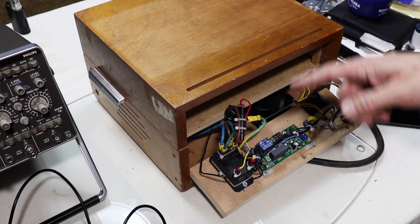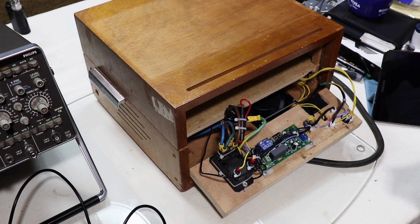And it had an aluminium front panel and then a slot here in the front where you put in an 8-inch or up to an 8-inch reel-to-reel recording tape. And there was like a plunger you press down here, and then that switched on a big electromagnet and wiped the tape. And it's a bit of a shame that I've butchered this thing, but I needed an eraser that would handle larger tapes. I use a lot of 10.5-inch tapes. Plus also be easier to play with an electromagnet if it's all open rather than enclosed in here, to stop you hurting yourself. So I did some modification.